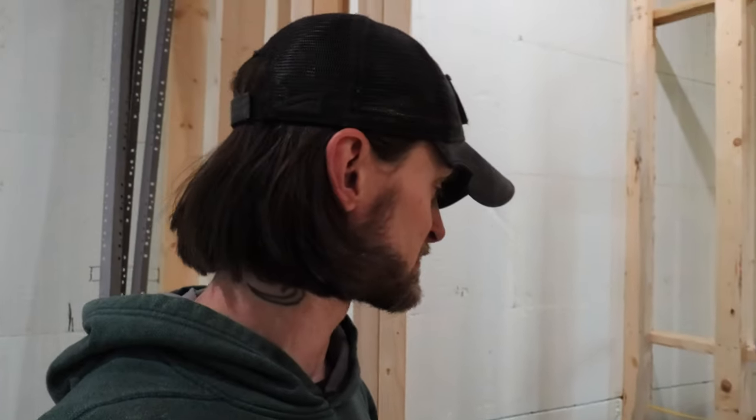and that's because of the dryer vent. It is a 4-inch solid metal pipe and you're not allowed to crush that. So obviously 4 inches is not going to fit in a 3.5-inch hole. So now we have 5 inches. We lost 1.5 inches of pantry space in here, but nothing that you're ever going to notice. But that should give us enough room to get the dryer vent either going up and outside or going down through the basement and outside.